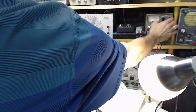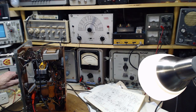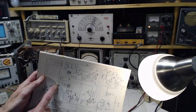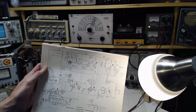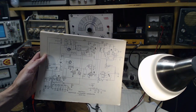I got it on milliamps. Let's see, what's the voltage? Still 20 volts. Okay, I'm going to flip the band switch and watch that meter. So one of the extreme settings should cause a variation on that meter. And see anything happen at all. And why would you say that should be a variation? Because in one position, this resistor is shorted out of the circuit. It didn't seem to do anything to the current flow. This doesn't make a lot of sense.